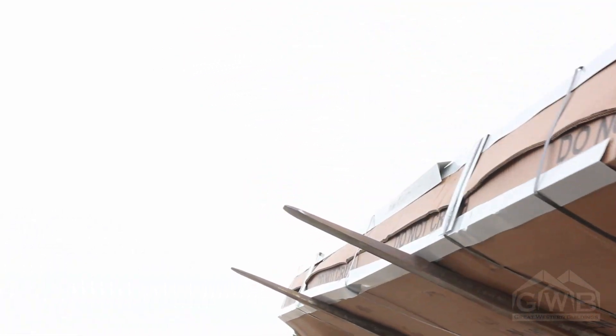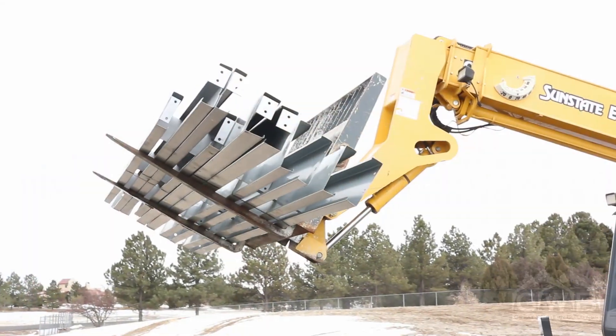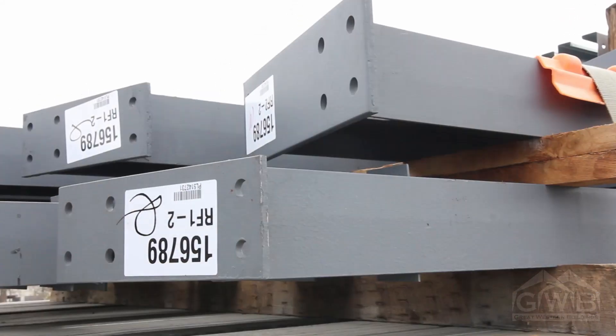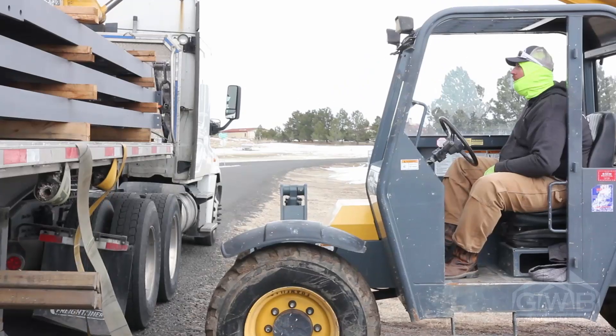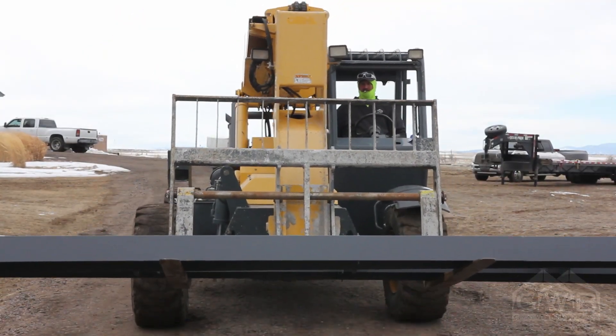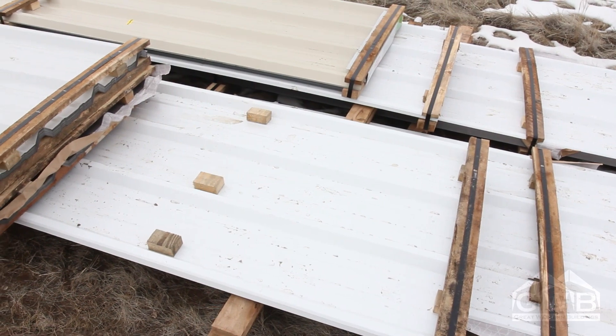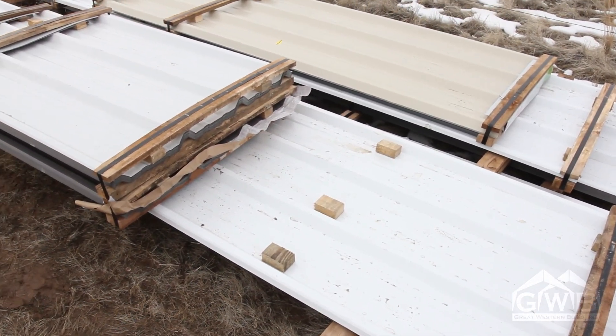Your trim and windows will be loaded on top of the truck because they're fragile. These items are also usually the last parts to be installed, so go ahead and move them somewhere safe out of the way or behind the other materials. Your panels and cold form parts will be nested and placed in larger bundles. The heavy structural columns and rafters are not bundled, so they'll be labeled individually. To be safe, lift the bundles and parts from their center of gravity. Tapered frames can be heavier on one end, so it may be necessary to adjust the pick location a couple of times to get it right. The dunnage or wood blocks on the truck should be used on the job site to keep building parts off the ground — this will help you pick up materials later and protects the steel from ground wetness.